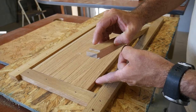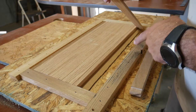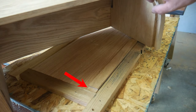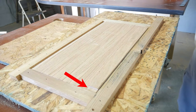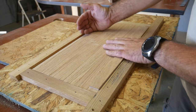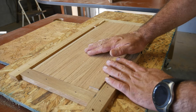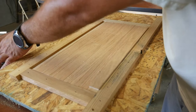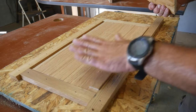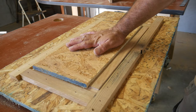This piece is a little bit thicker so I put cardboard underneath to make up the gap so that the part that fits into the groove lines up correctly. I'm going to use wedges to put pressure so that it closes all the gaps and no glue gets in between the boards. Once that's done, I'll cover it with glue, put the fabric on there, spread it out, press it down, and put some weight on top.